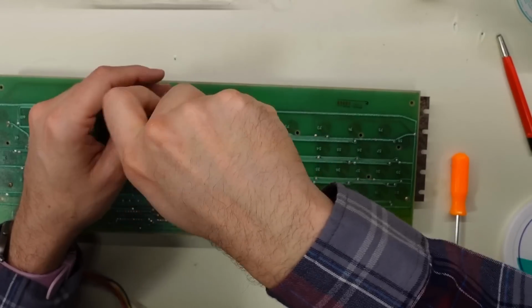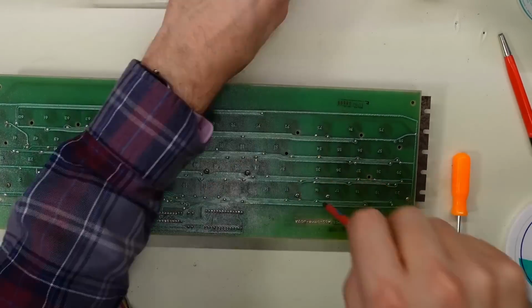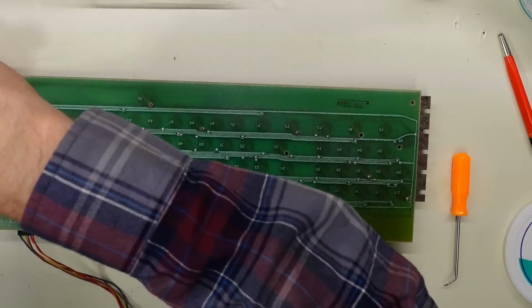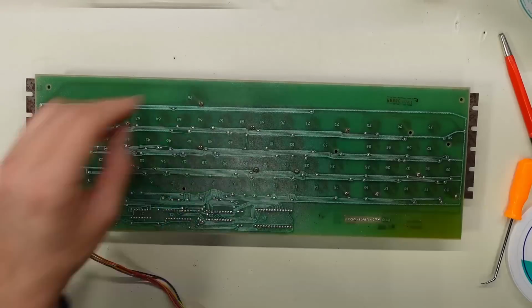The screws that hold the PCB down screw into the black plastic part of the slider, so if you have a slider where the little screw hole has cracked or doesn't hold anymore, you can just move that slider between 2 different spots on the keyboard so you can get one under the screw hole that's not broken.